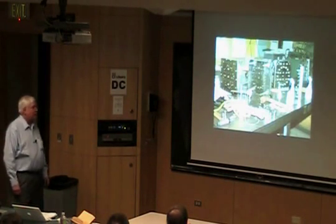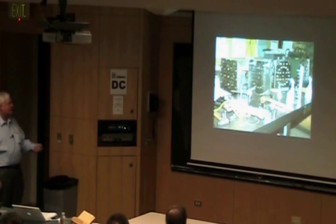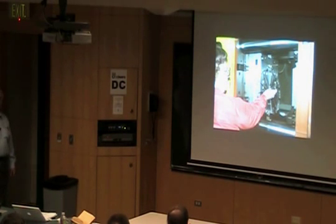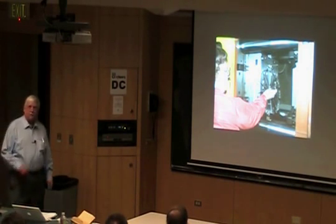Pretty anyway. Now, if you're going to make parts like this that involve molding, you need a very strong workbench to start with. And you make a steel mold with a lot of plates and a lot of holes for all these optical components that are in place when you're squirting plastic into the mold. If you do this right, you can mold your lenses maybe 24 at a time for no extra cost. You've made the tools, you've got the freeform shape in there. The molding machine doesn't care whether it's freeform, it just gives you lenses. They come out, yes, they're already polished.